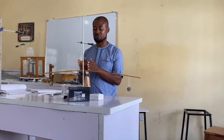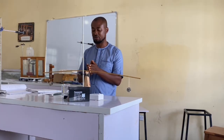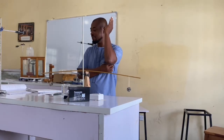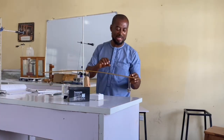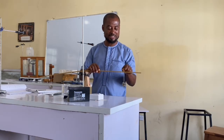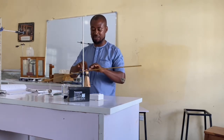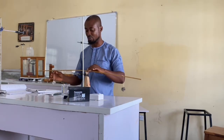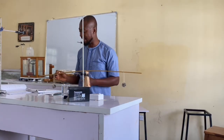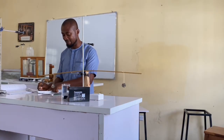Now I have to subtract the balance point from the center of gravity. So I will subtract it from my center of gravity — 49.3 minus 10.9. Thereafter, I adjust to the next 5-centimeter increment, which is 15 centimeters. I try to balance it with my center of gravity maintained on the knife edge, and at 15 centimeters I get a balance point of 15.9 centimeters.